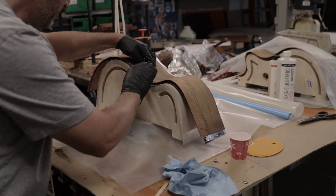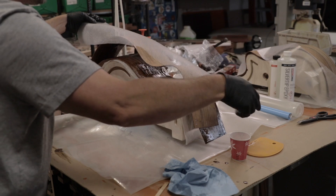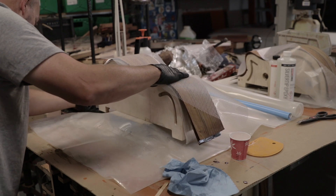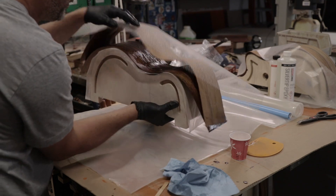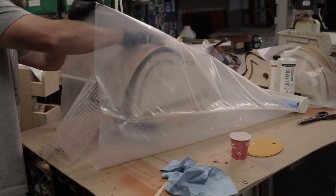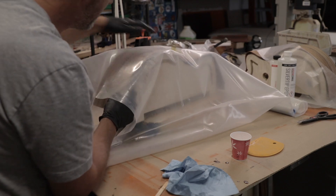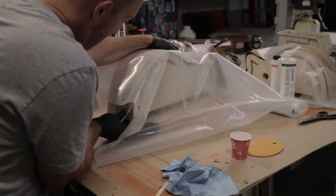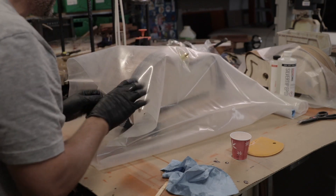So that's essentially how they're going to sit. I need to make sure my wax paper is covering the mold here. We'll put our plastic on top of this - this is so that air can get all the way around the sides. I feel like we're in pretty good shape right there to go into the bag. We'll put our plastic over the top here, just lining the sides up with one another. I feel like that's something I can wrestle into place as we start sucking the air out.